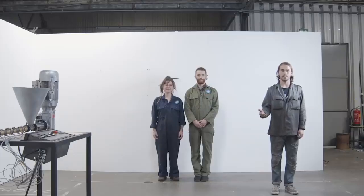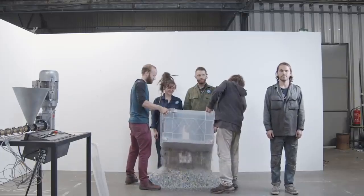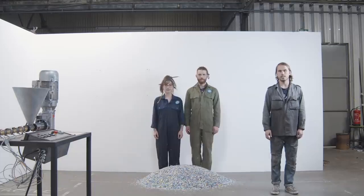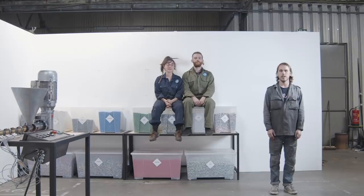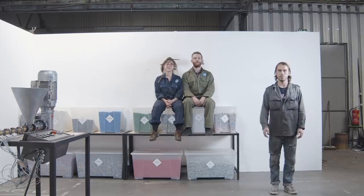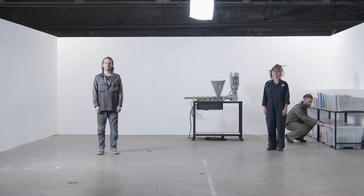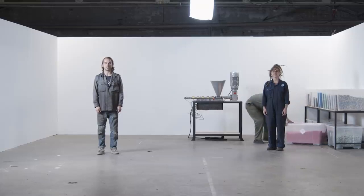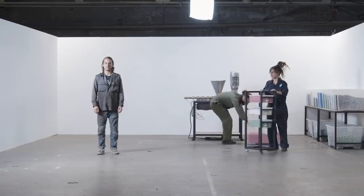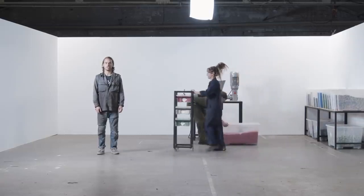You've got your machine — now you need plastic. Check out the Precious Plastic Map to find a shredder workspace near you. We recommend using durable containers to store your plastic. It's nice to have big ones for the colors that you use often and smaller ones for the special colors that add variety to your product. It's also nice to have a scoop nearby. Big containers are great for storing plastic, but they're not much fun to drag around the workspace — use smaller containers to transport your plastic from the storage to the machine.